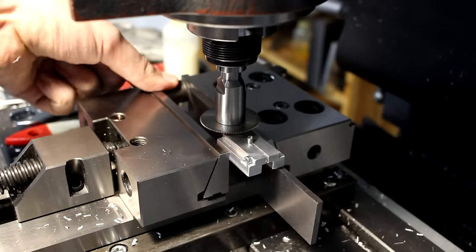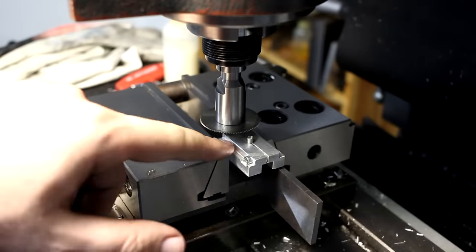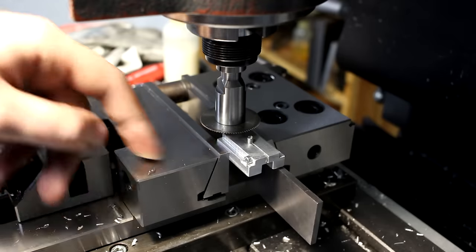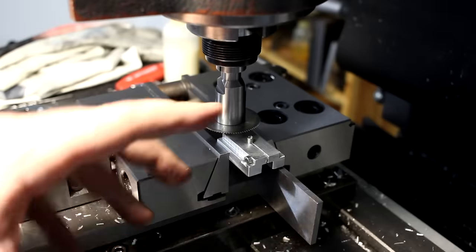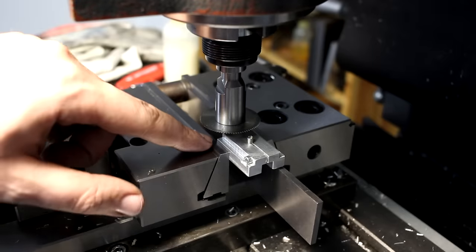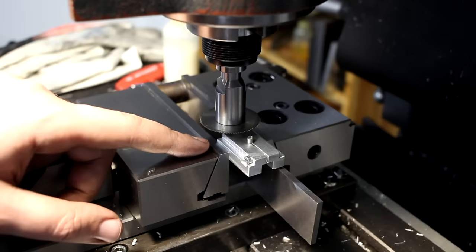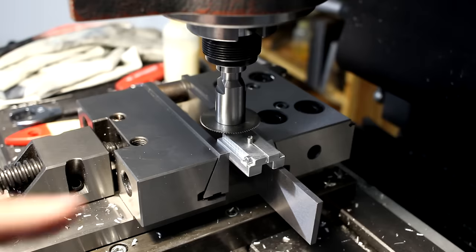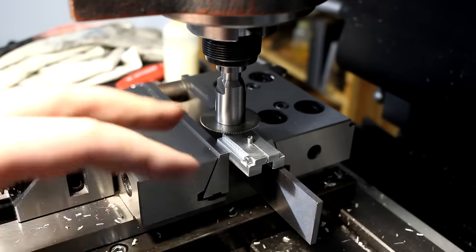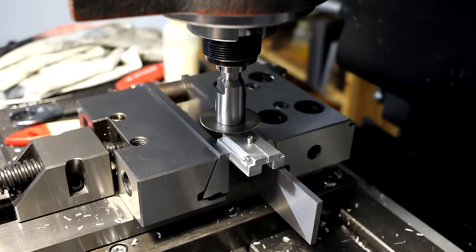And yes, I balanced out the vise jaw again, not to rock it too crazy, and to get a secure grip on this part. If you don't do this, the holding force on a part out here is a little bit bad, because you're basically only holding in a line contact, not in an area contact. I will show the fixture once I'm done with this run of parts. It's already set up, obviously.